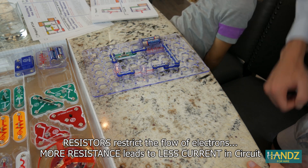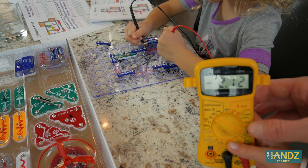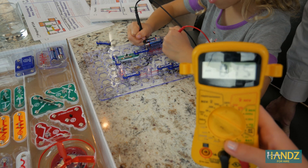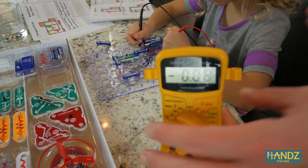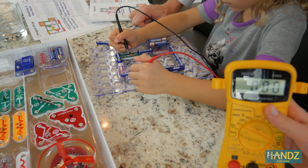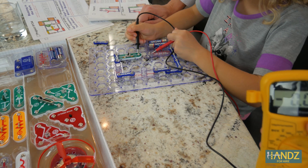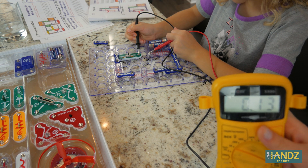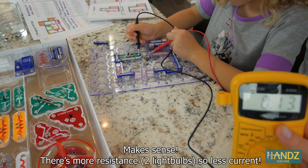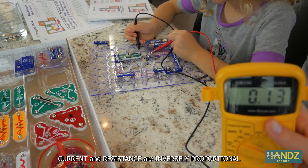These light bulbs are dimmer because the electricity flowing through is shared between the two — these light bulbs act as resistors. So we get 2.72 volts, which might be slightly lower because we caused the batteries to run down a little from shorting. Now measuring current: we get 0.13 amps — a little bit less current flowing through because there's more resistance in the circuit. We also have a little bit less voltage.